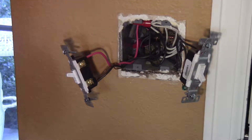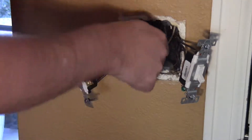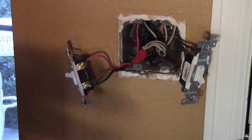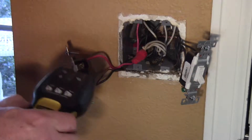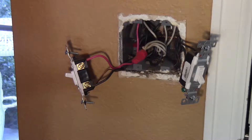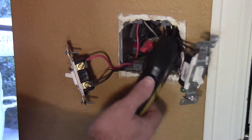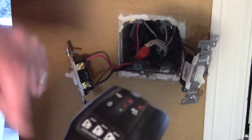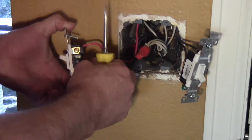I still need to go to the hardware store and get a Decora light switch plate with the regular light switch and the Decora opening. These white wires here are the neutrals, so I definitely have a neutral there — all is well. Even though I turned the breaker off, I should still sniff around in here for live voltage. Everything's dead in there. This is just a stud finder but it also has a voltage sensor built into it.